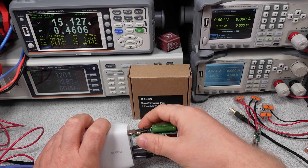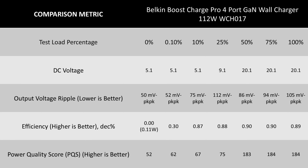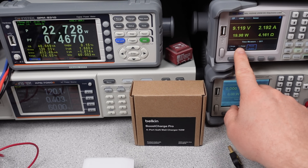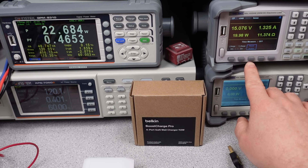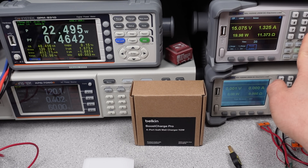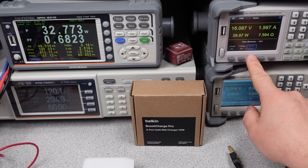In terms of its basic performance, the charger as an independent island looks not bad. Achieving high 80s percent efficiency for a mass produced product is an accomplishment, but is it enough? The DC voltage is fairly stable and the overall level is basically right on the rating, so in terms of being compatible with your devices, it shouldn't create too many issues. You can see that the middle of the charging turns on the power factor correction — the power quality score suddenly jumps up. At lower power levels it does not turn it on. The efficiency does have a peak around 50% of the load, and as the power level goes up, the dropping efficiency means this charger is probably being pushed a little too hard and will likely run into some issues with the next test.